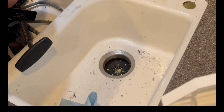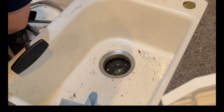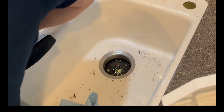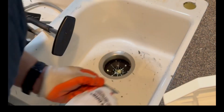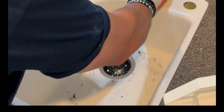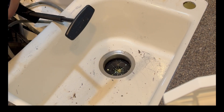If you're using caulking as a way to insulate your home from heat transfer, you want to make sure all the old caulking is removed before you try to reseal windows. In the case of the sink, you also want to make sure all the old caulking is removed so that water doesn't travel in spots where you don't want it.